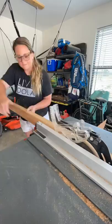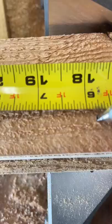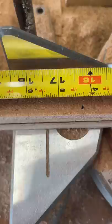I take three of the planks and rip them in half — that part is completely optional. The fourth plank I rip into fourths, which I use for the corner supports and the trim. I'm able to make four cuts out of each cedar picket that I've ripped in half. These will make up the sidewalls. I added a full cut list and materials list at the end of this video that you can screenshot. I also cut down the trim and the corner supports.